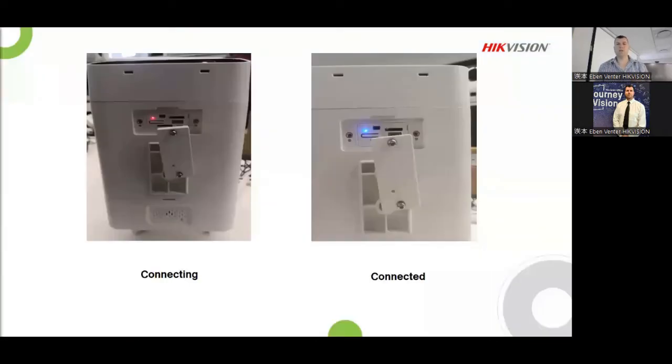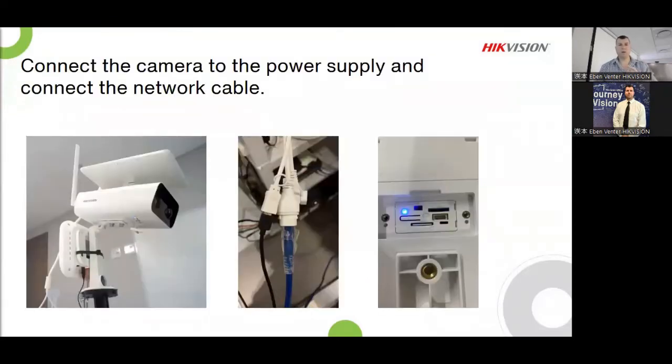So, right, let's activate the device. Very importantly, I'm just going to skip ahead quickly with one page. You'll see on the cabling side of these cameras, you'll have a RJ45 plug. You'll also have a USB plug. There will be a power jack as well. That normal 12-volt power jack itself is not there to supply power. It's also not there to receive power. Ignore it. Use the USB to power up or charge the device at your office, on your desk, if you need to set it up, whatever the case is.